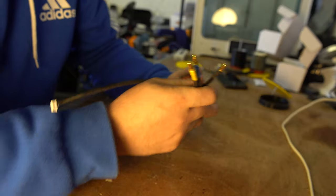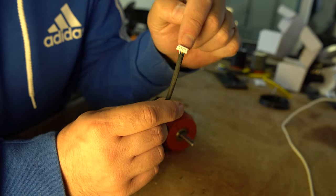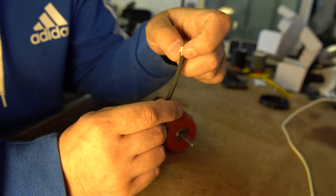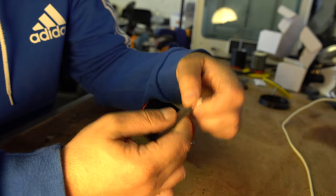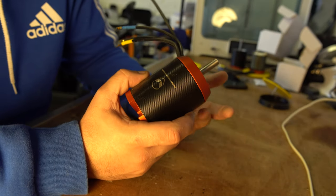Because of that there are now three wires instead of two. The fourth wire is a sensor wire and this provides positional information back to the speed controller from hall sensors that are built in, and also temperature monitoring back to the speed controller. That's what those wires are for.